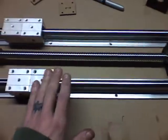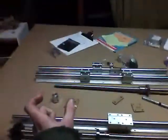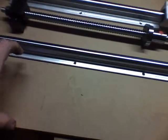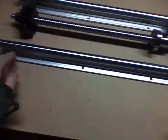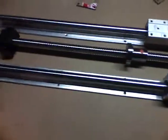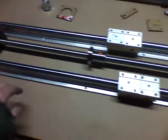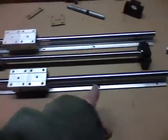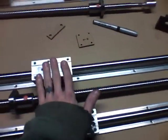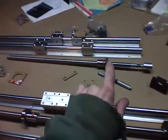These two are the gantry pieces, and when I'm trying to parallel them with the deck I think it's going to be very nice — I can use a dial indicator or a parallel to space them off the deck properly, then put the screws in. Like we do in the cabinet world, just put the end screws so we have more room to fudge it if we need to. So, almost six hundred bucks for glides and screws.